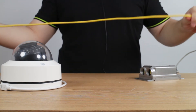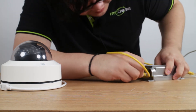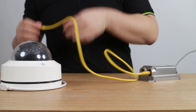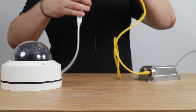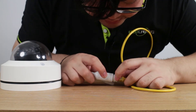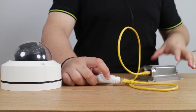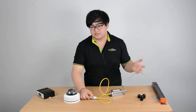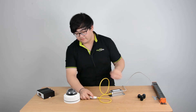Now use this ethernet cable — one end into a PoE OUT port, and then one into the PoE input on the camera. You can see this orange indicator is blinking, which also indicates that the whole system is functioning properly. Now all we have to do is wait for the whole system to run its self-diagnosis, and then the camera will be functional.